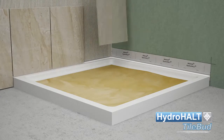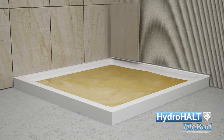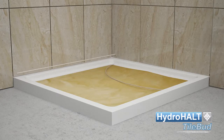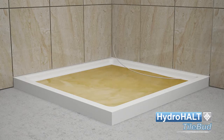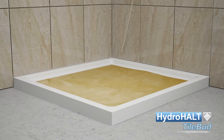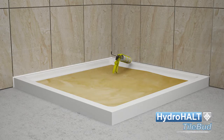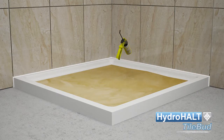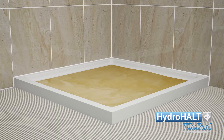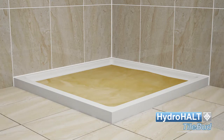We recommend the insertion of a sealant backer rod into the joint formed between the tile and adjacent ledge. This sealant backer rod will shutter and shape the sealant cross-section, enabling it to stretch and accommodate joint expansion. The sealant joint between the tile and ledge should not be considered a permanent joint seal because it is exposed to the climate and chemicals of the showering environment and will deteriorate over time, further accelerated by the stress of elongation under joint expansion.